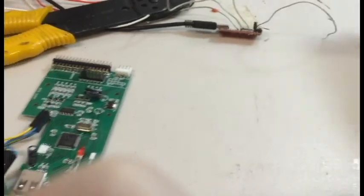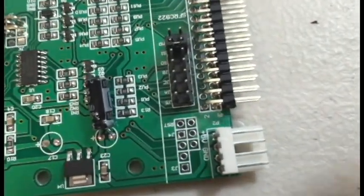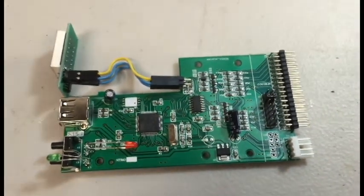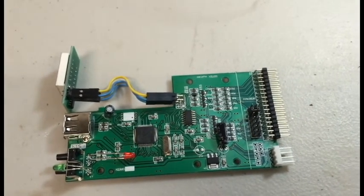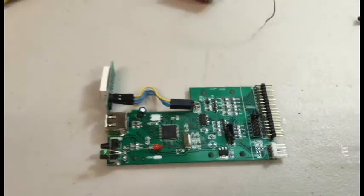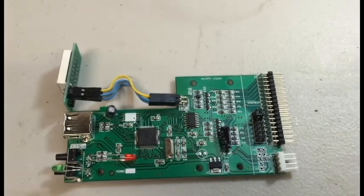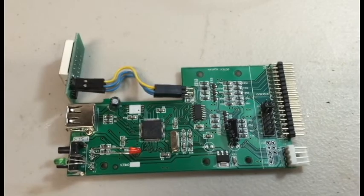Once you've got the GoTek board out of the case, we're really going to be focusing on this section used for programming. I've done this once before — I followed a guide on bogons.org, which is a really great guide. I'm going to post a link to it in the video description and I'd definitely recommend you check it out. Essentially I'm going to be following the exact same steps, and in that guide they specify that the GoTek is programmed using an LV TTL 3.3-volt serial interface.